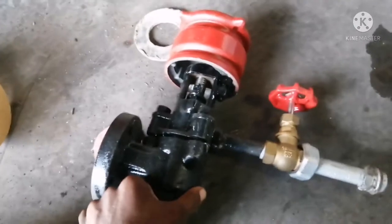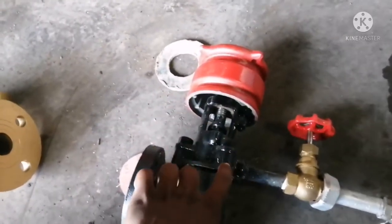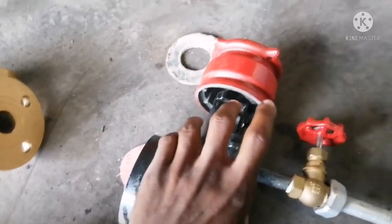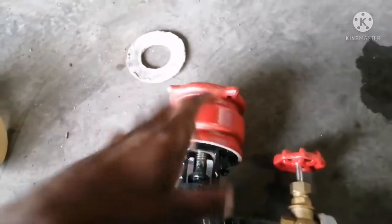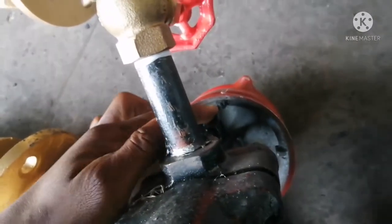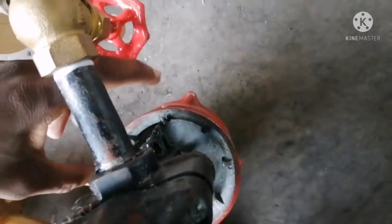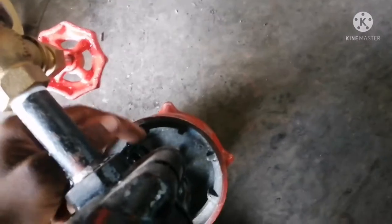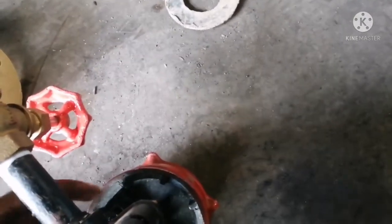If you want to perform the blowdowns, you will notice that when you start turning this lever — two and a half turns for steam blowdowns, then fully closed for water blowdown — you cannot close it before you finish; you have closed it completely. Why? Because we have a pin. This pin locks to these teeth here. So when you haven't reached the end and completely closed, this pin will still be locking you in. So when you're closing it, you hear a knock sound, knock sound, knock sound. This is the pin coming up, coming out, and flowing.